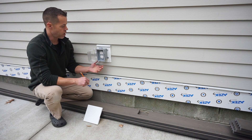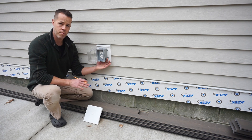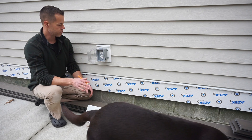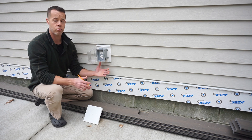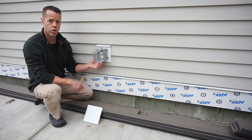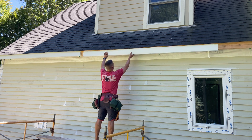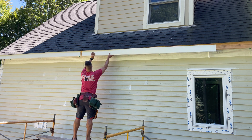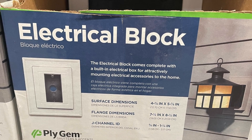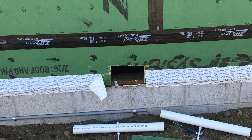Now you may be tempted to try to recess this outlet box by cutting a hole in your siding. I don't like that for a few different reasons. The main reason is it's a great way for cold air to get into the house — I live in Michigan and I'm trying to keep cold air out in the winter. Another reason is you cut a nice big hole in the side of your house, which is a great way for bugs to get in. I just like a small hole that the wire can come out of, and a nice flat piece of PVC or wood for the outlet box to sit on. This works for a wood sided house, board and batten, or a brick house. Things get a little different with vinyl siding — I'm not a vinyl siding expert, but there are many options available. Either way, I would advise against cutting holes in the side of the house; I just think it's bad practice.